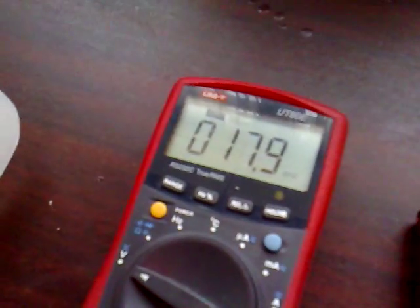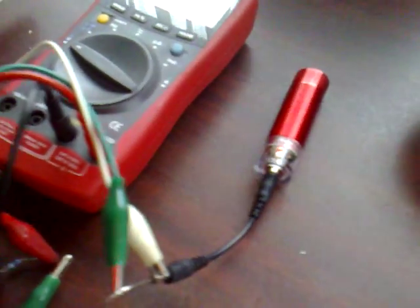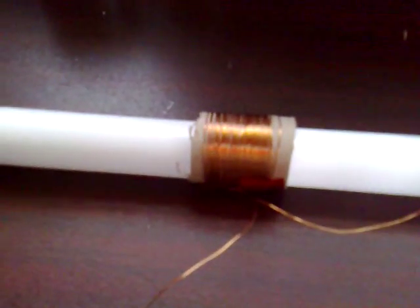The circuit's running and it's drawing 18 milliamps, and I'm using one of these 1.5 volt emergency phone chargers to power the circuit. And I'm lighting a fluorescent. I'm not using the normal inputs for the fluorescent — the end bits — or lighting it wirelessly. I'm using a coil of wire wrapped around it, and the HV from L1 comes out and into one side of that coil, and I've just got the other end dangling. It's doing nothing at the moment.